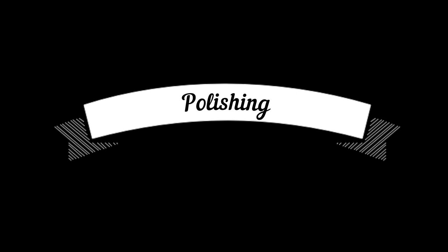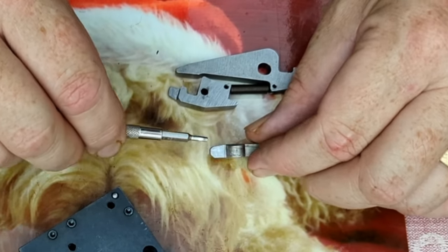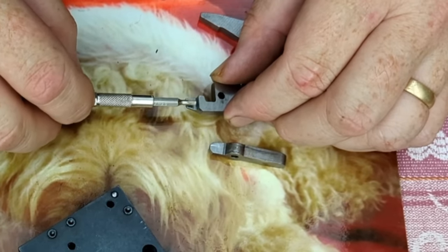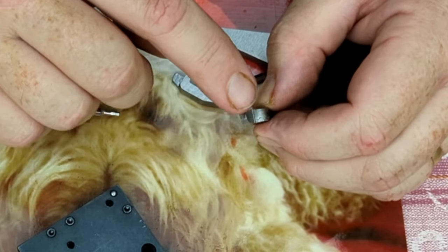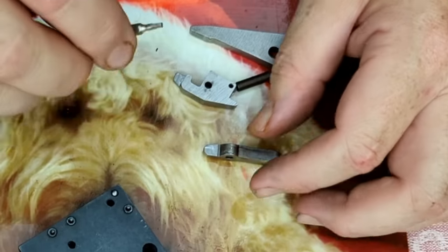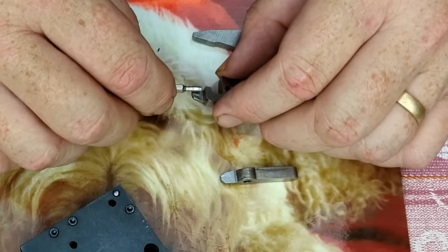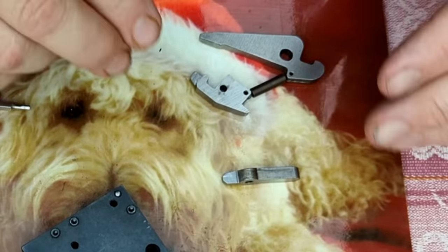You only need to really polish three surfaces. That is this part here on this trigger sear, over here on this one, and you've also got this blade here. You also need to polish this piece on the end. As I said, you do not want to be grinding. The only time you'd take any kind of thousand-grit emery cloth to it is if there were ridges and digs in it, because this is all case hardened and the last thing you want is to go beyond that because then it will become soft. So polish here, polish here, and polish here.